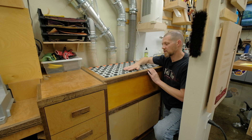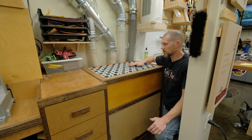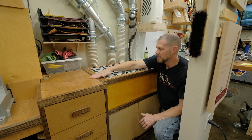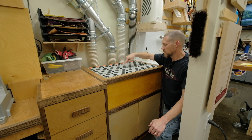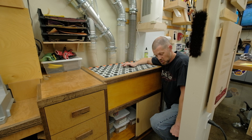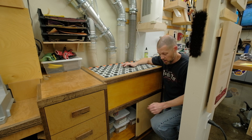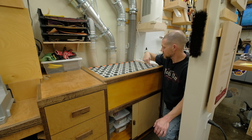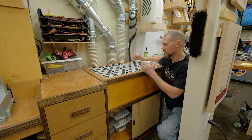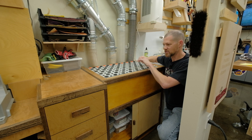It was a definite requirement that these panels could not sit proud of this surface. I wanted to make sure I could dial in the height once everything was put in place so these grommets would be at the exact same level as the surface of the miter saw station. I didn't start with plans — I built the box that the downdraft panels sit on, then built the cabinet around the box based on those dimension constraints. I started with a known set of required dimensions and a known size of the downdraft panels, and just built from there.